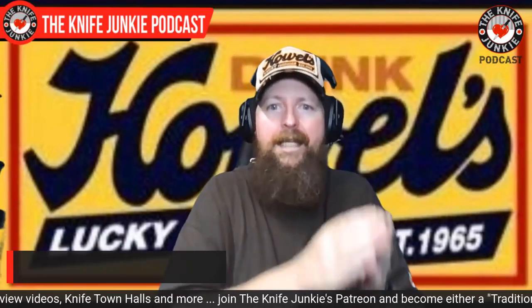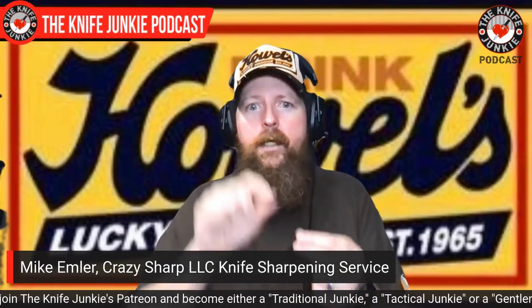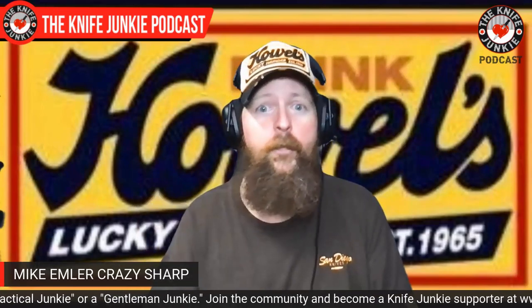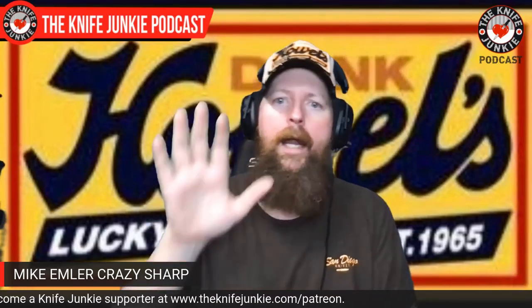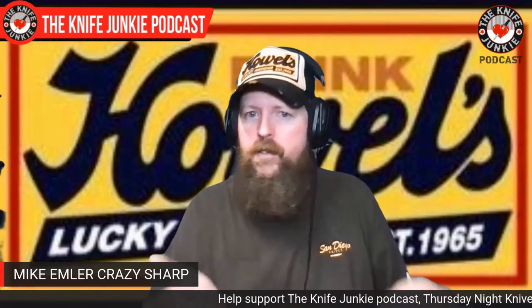Some companies are making their Damascus with one element — a high nickel steel that will not austenize. So it's not a hardening steel. You don't get the same hardness throughout. You'll have spots where you sharpen it, and after a couple uses you can feel areas where that steel has deformed or worn away — like a sawtooth. Vegas Forge — I love those guys — but they use in some of their steels a non-austenizing high nickel content steel that allows it to shine through when they fold it. For aesthetics, great. But if you're going to carry it in the field and use it, not so great. Some smiths will forge copper in — not near the cutting edge but as an outer clad — and that's fine, that's gorgeous. That's like a Sanmai, where you have a center core of high carbon steel jacketed in softer material.